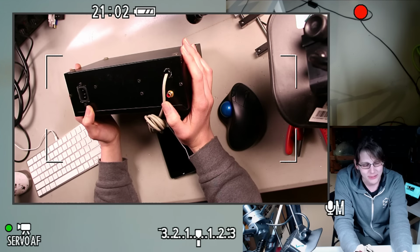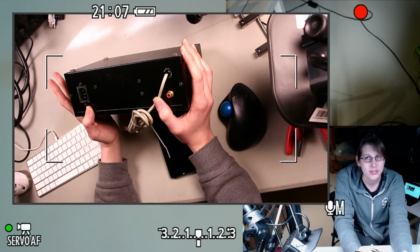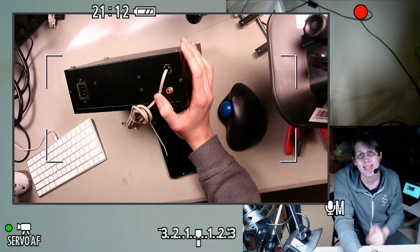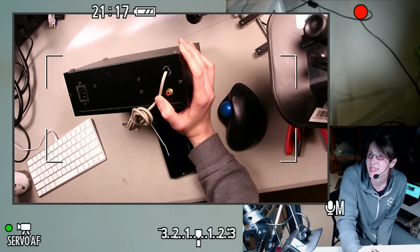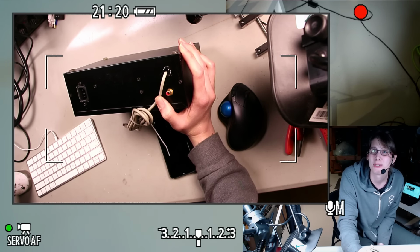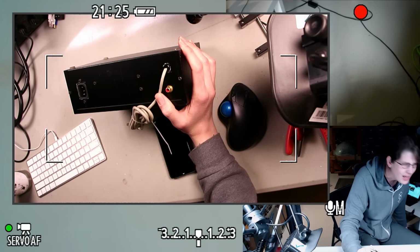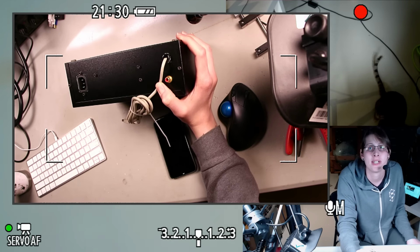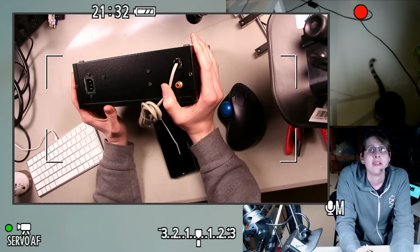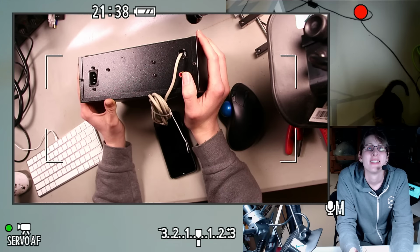But that was a companion project to this eventually, where it was a video matrix switch. I don't even remember how many outputs. It was like a video crossbar with 8 inputs and 3 outputs or something like that. I built it around a bunch of discrete analog multiplexer chips. It was a really weird design. I think I messed up something about the common mode range too, because I didn't really understand much about analog when I designed that. Anyway, so this had some weird siblings.